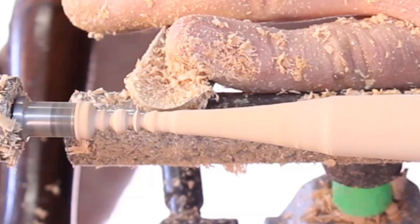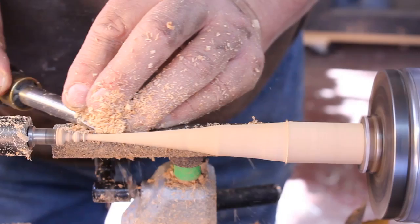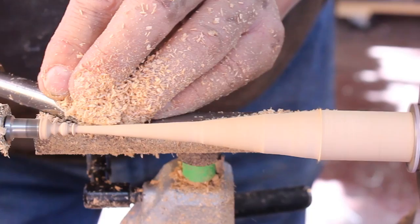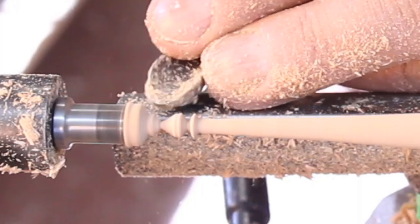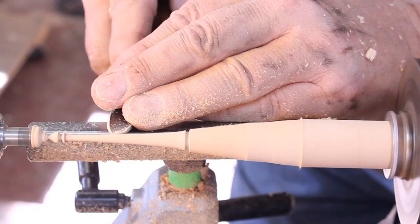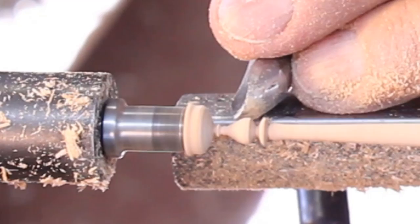Here I am taking a little bit more wood off with the spindle roughing gouge, and now doing just a little bit of scraping with my detail gouge. It really helps to have the tail center up at this point — I can take a little heavier cut. Here I'm back at the very end doing a little more fine profiling, and in a second I'll cut through this and won't be able to use my tail stock anymore. I continue to take off a little more wood at the very end, shaping the very top of the finial, then part through this to develop a bit of a point — and there it is.